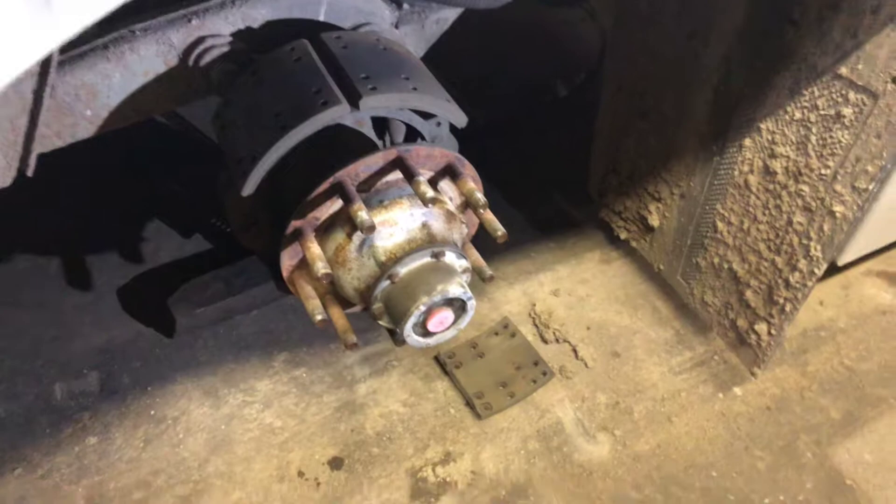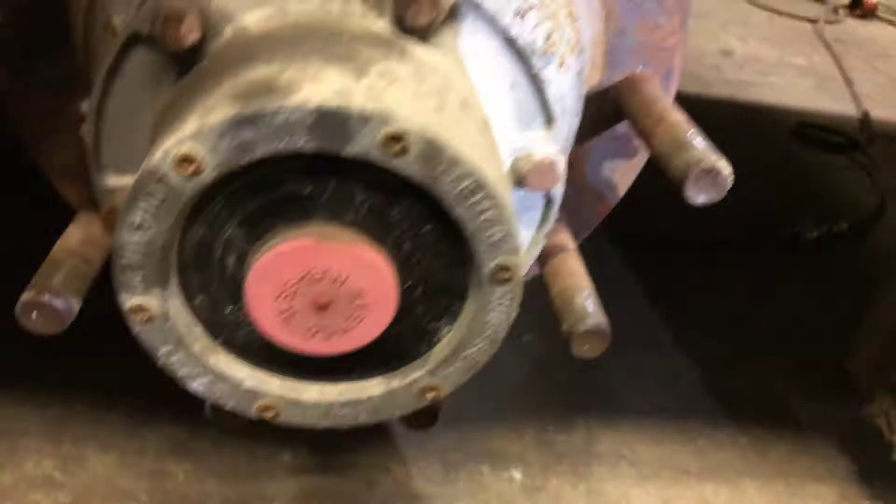What I was doing was changing oilers because every one was leaking and they were mismatched. This is a trailer — I was jacking and lifting it up on each individual axle and checking wheel bearings, making sure they're all tight. This is my last one. I checked all three of them; the one over there kitty-corner from here was loose, so I was putting a jack under the axle.